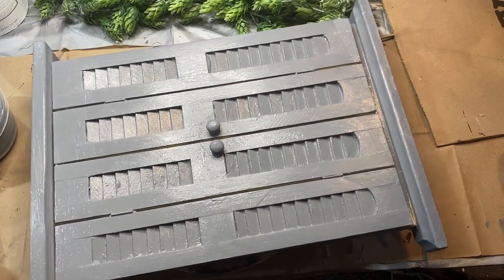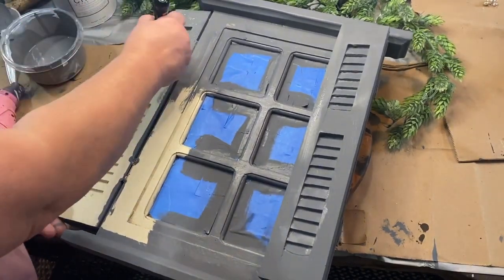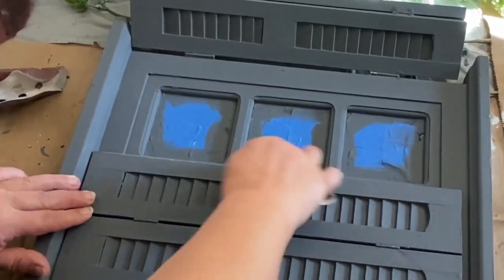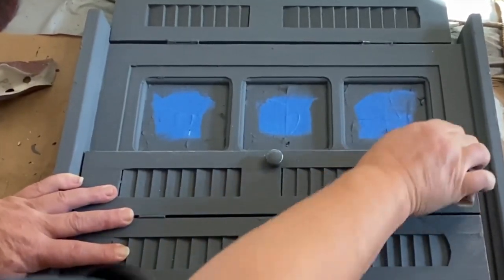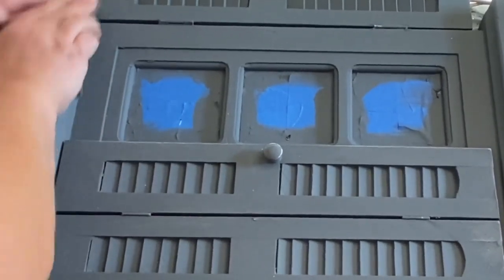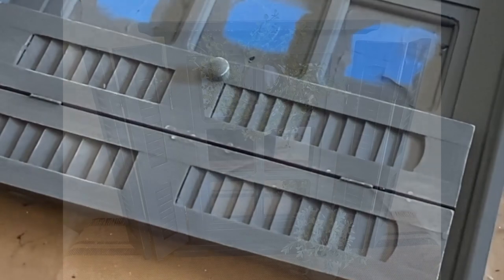Once I got the outside finished I did the back, then went in and taped off the mirror so I could paint the inside. I did try to take the back of the mirror off to remove it, but it was glued in really well, so I just taped it up for a nice paint job around it. Even where I got paint on the glass I just went back with a razor blade and cleaned it off — pretty simple. Now I'm going over it with sandpaper, cleaning it up and making it look distressed around the edges. I gave it a coat of sealer and it's all finished.